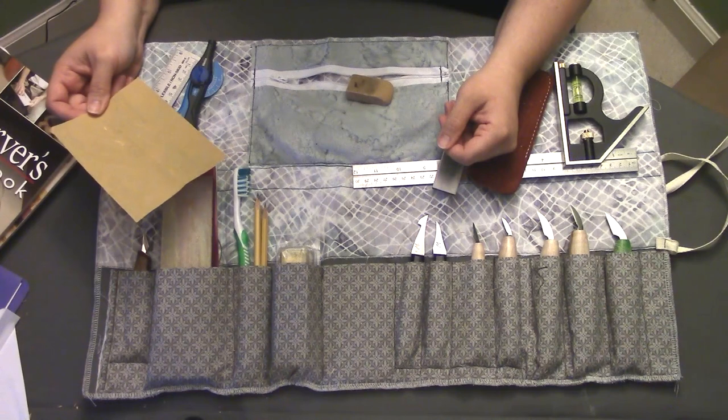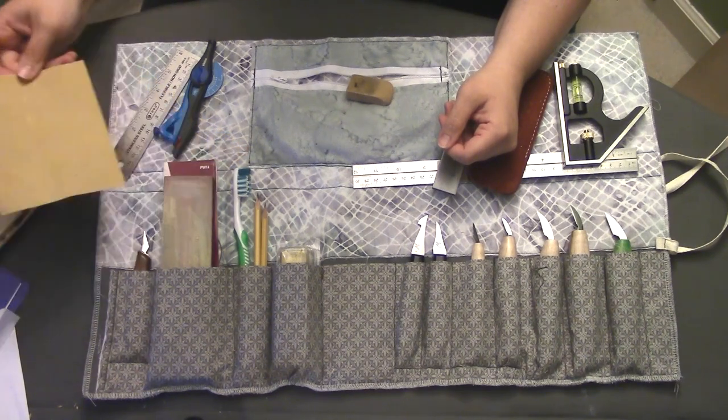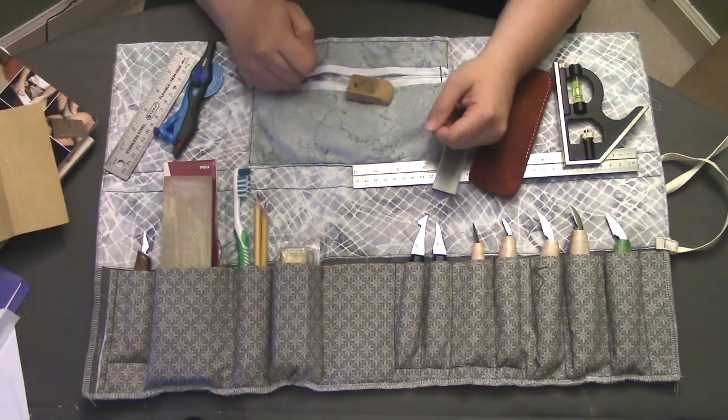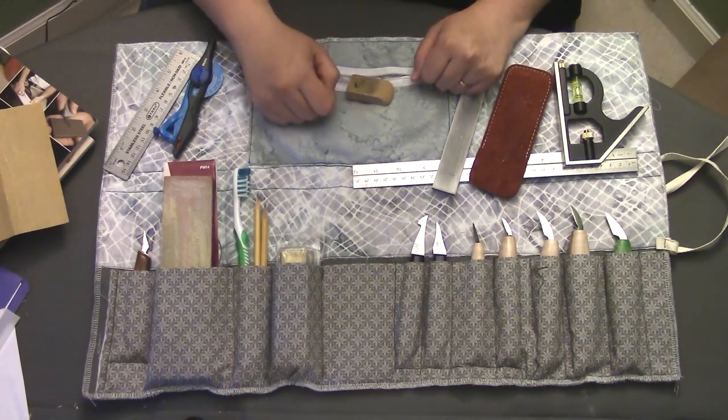Prepping the surface with fine grit sandpaper makes it easier to lay out the design and remove pencil or graphite marks when you're finished. Pencils are a must, and there are different schools of thought in regards to which type of pencil to use. In Dennis Moore's Chip Carver's Workbook, he goes in great detail on which type of lead to use, which I found very helpful. He also recommends using a mechanical pencil because it gives you nice thin lines.